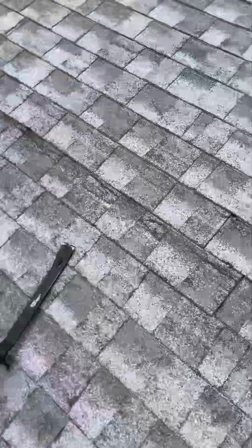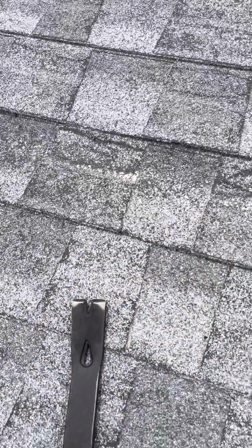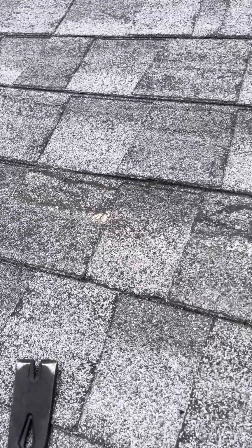So we've extracted the shingle that needs to be repaired. That was marked here by the adjuster for wind damage. We not only have 4 holes now, we have a total of 8 more holes that we have to try to repair with mastic and caulking to prevent any leaking to further disturb the lifespan of the roofing system.